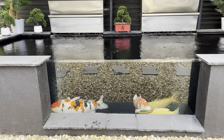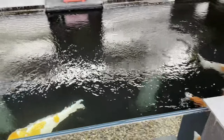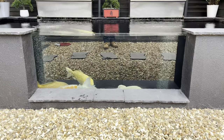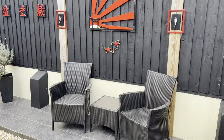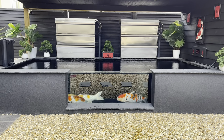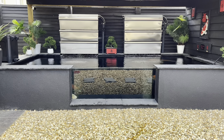Moving on from that, you can see there's one plume of air coming up there and another coming up there. The reason for that is when I built this pond I opted for two bottom drains - one down there and one down there - and I wanted them exactly equal distance apart from the window, so when you look through the window in the centre you don't have to see the air coming up. It worked out an absolute treat. On a Sunday morning in the garden with my morning cuppa, this is where I like to sit - and the view I get is exactly what you're seeing on screen. That's part of the reason I opted for the two bottom drains either side, viewing straight between - I call it a big five-foot TV, not a window.